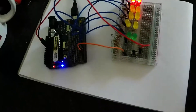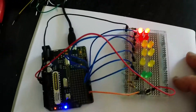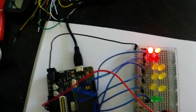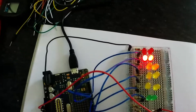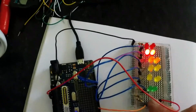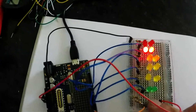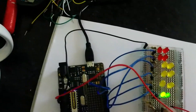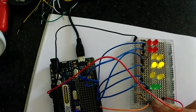This is what I've come up with — it's meant to be a drag racing Christmas tree. It has a start button. The red LEDs indicate staging: set your cars up, stage one, stage two. Then there are three yellow lights followed by green, each with a half-second interval. Green means go — race! So you push the button: prepare your cars, position, race!